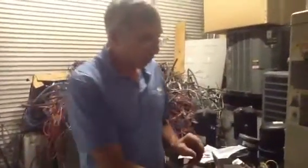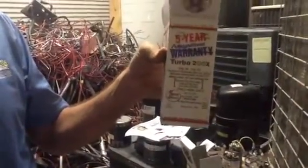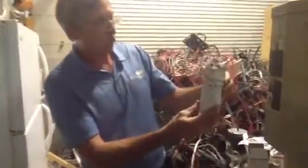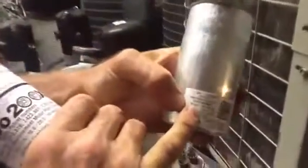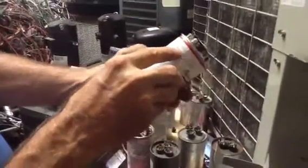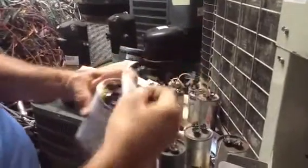Now here's the big one — the Turbo 200X. This is for your big capacitors, your big units, like your 4-ton and 5-ton units, and sometimes commercial. Once again, keep it in the vertical position. I'll pick this one up — this here is a 70 microfarad. So we come over here: 10, 20 — I'm going to jump 50 and 20, that's all I'm going to do.